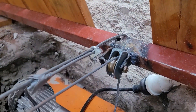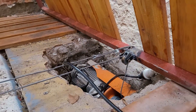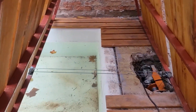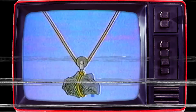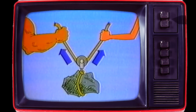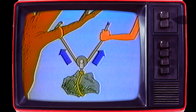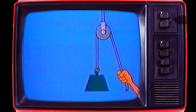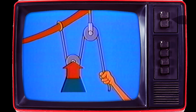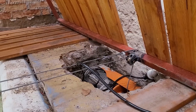I went back and anchored the cable again at the beginning. This back and forth has a reason: in this way, we benefit from the pulley principle, a simple concept that allows us to easily double a mechanical force. Two people each hold a segment of rope, so they share the load equally — each needs to lift with only half the force. The exact same thing happens if one end of the rope is fixed: you also need to lift with a force equal to just half the weight of the load. Combining a fixed and a movable pulley gives the advantages of both, doubling your force while allowing you to pull downwards. Our engine now exerts 250 kilograms of force — double — but it also goes at half the speed. That is the trade-off we have to make.